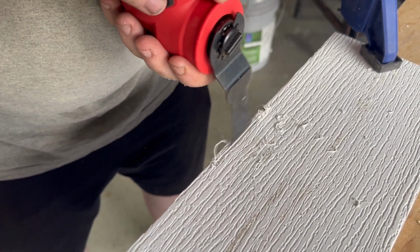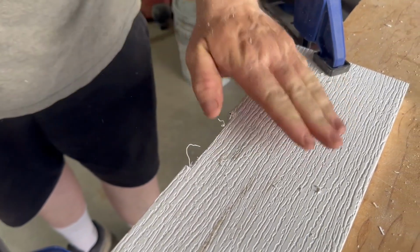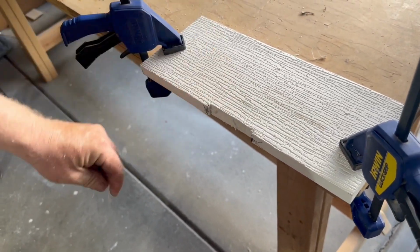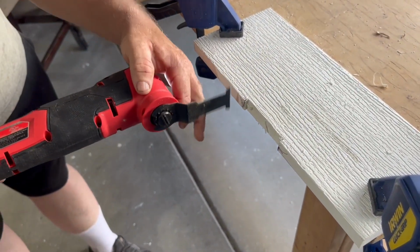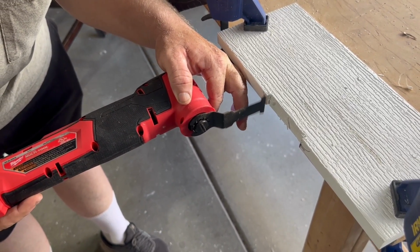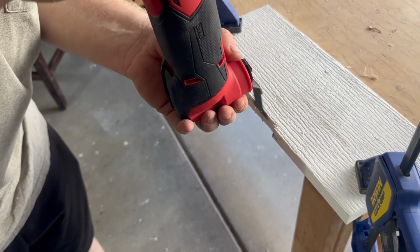We decided we're going to move this trim up just a little bit. It's still going to protect the boards underneath, but will hopefully let a little bit of airflow through to help dry things out if water does get into anything. We also, like I said, primed the bottom of those boards, hoping to keep everything a little bit more waterproof than we found it.